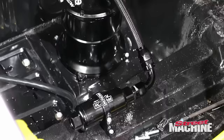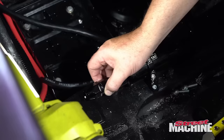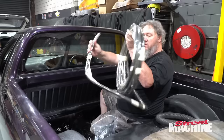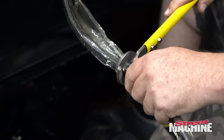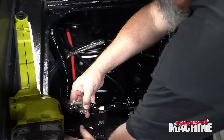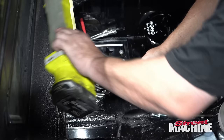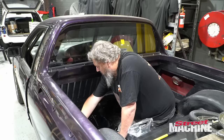Now the other end. We've got some Dash 10 line here. If we go like that, that's within our bend radius. Let's just double check our tape measure. Yep — that's within 170. Let's put that hose end on, and then we'll work out where the other end's at.